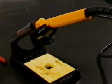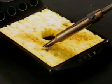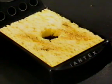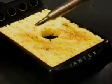Switch the soldering iron on and wait about 5 minutes for it to warm up before use. When hot, apply a little solder to the tip and wipe on a damp sponge. Repeat this operation regularly during soldering to prevent a build up of flux or excessive solder on the tip.